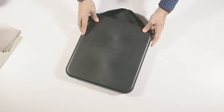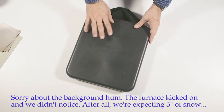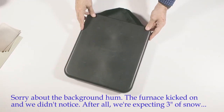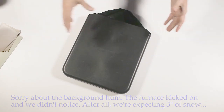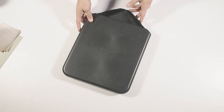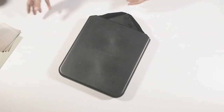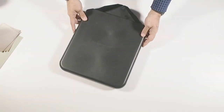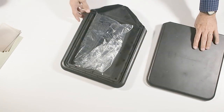As we mentioned in some of the other emails, the surface finish on the lid is not quite, shall we say, perfected yet. That's a side effect of the fact they haven't cut the cooling channels into the mold, so the mold gets a little too hot during the process. That's something they'll do after we have approved the mold, then they'll optimize it for production, but that's purely a cosmetic issue that we aren't too concerned about right now.